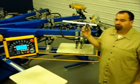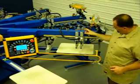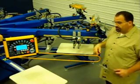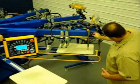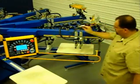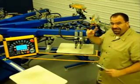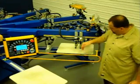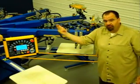Okay, basically we're going to be using a simple carpenter's square. Now, we've leveled our shaft. Our head is traveling along a linear path. All of our heads have to travel on the same linear path in relation to the main shaft. So how do we assure that the machine has been installed correctly? We simply take the carpenter's square, we place it, we set it to where it touches our pallet in the front, and we check it to where it touches our pallet in the back. This relationship from here to here should be the same on every head, so that the relationship between here and the pallet are the same. So our squeegee and our flood bar are traveling along the same plane of the pallet, not just in this head, but in every head.